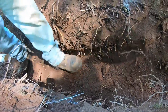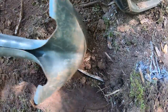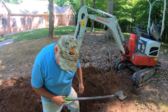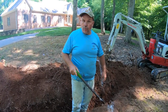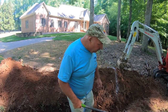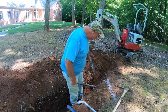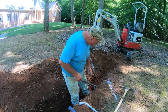We've got fall going across there so I'm going to fill that back in and keep digging. We've got another little 110 line right here. This stuff's all private — the locators don't locate it. It's kind of up to us, and if we tear it up we've got to put it back and fix it. On a small job like this, hitting the water line will ruin your day — you might spend hours trying to find parts to fix it, going to Lowe's or the plumbing supply store. Best thing is to try to locate that stuff ahead of time.